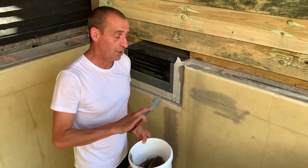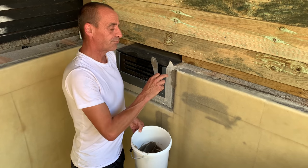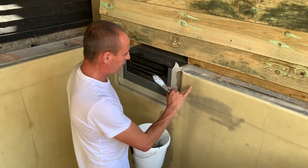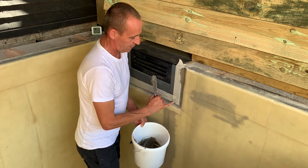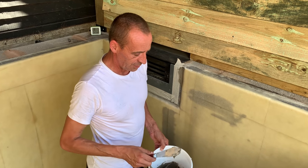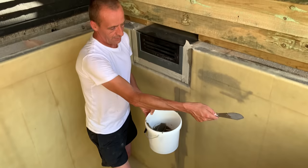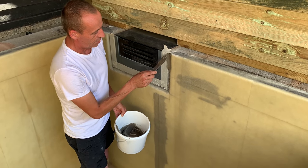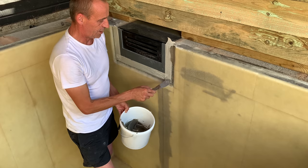To be honest, I've got to level with you. I don't normally mask these skimmers off, because what's going to happen is the flow coat tomorrow morning is going to come up slightly onto the skimmer face. And then what I'd normally suggest to a customer is, when they're bonding the window in, just smear some sealant around the pipe returns, where the fiberglass finishes in the drain, and the finishing point of the skimmer meeting the flow coat at that point there, all the way around.